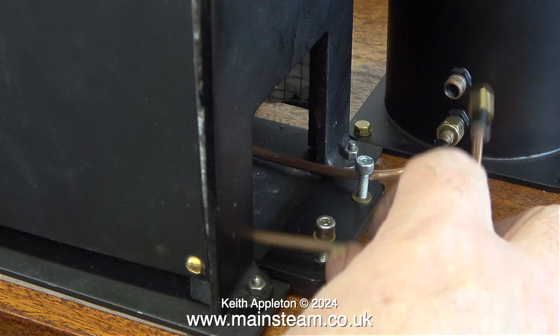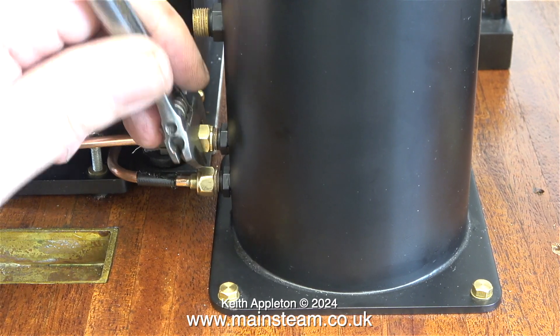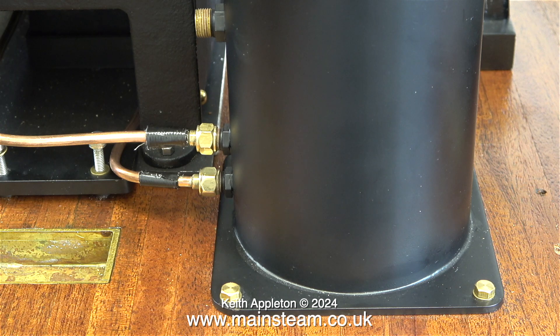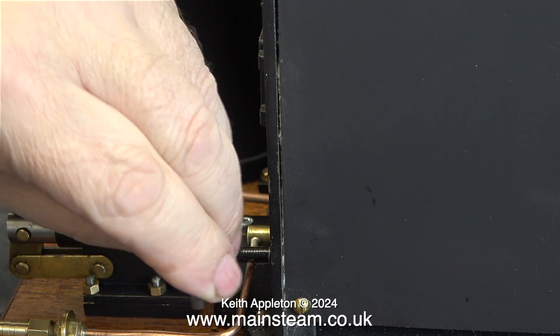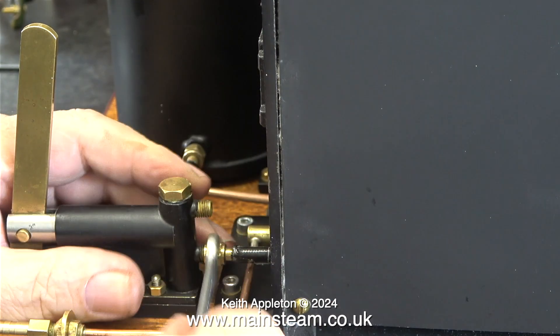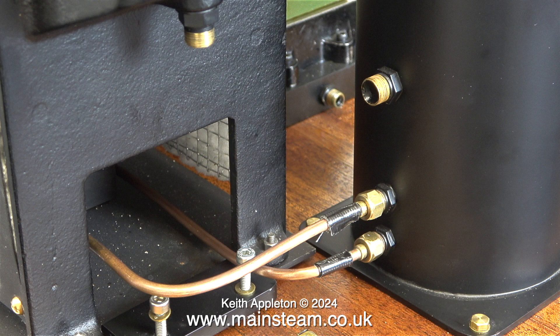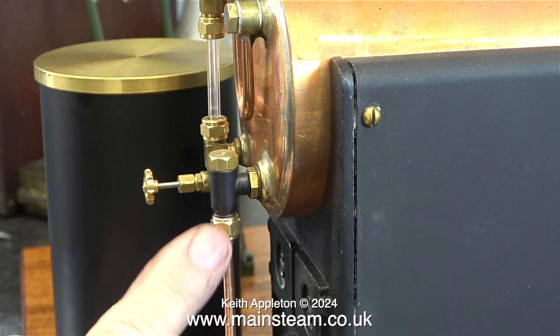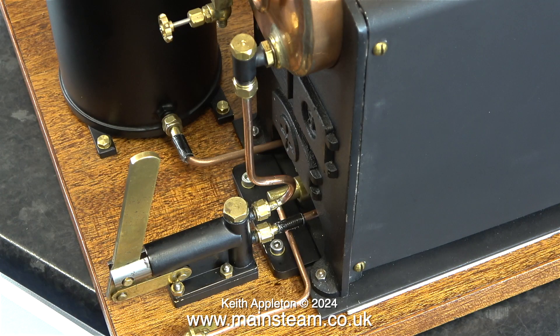The bent part of this pipe is much longer, and in this case I'm fitting the pipe to the top union of the economiser. It is absolutely vital not to over-tighten these union nuts — if you strip them, then there is a problem. You don't need to use any sealant whatsoever; the 60-degree union cone fits perfectly. This part of the job is a bit fiddly. I'm using a small spanner to tighten the union nut onto the pump at the bottom — this is the inlet — but you need to be very careful you don't damage the upper union with the spanner. And once again, you must not, under any circumstances, over-tighten the union nuts. The duct tape wrapped around the pipes looks a bit unsightly, but it's very easy to remove once the plant is assembled.